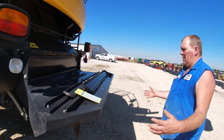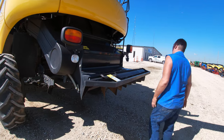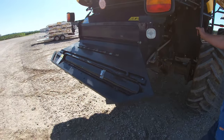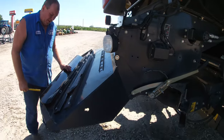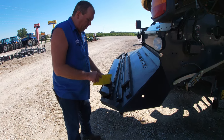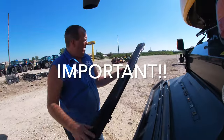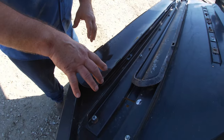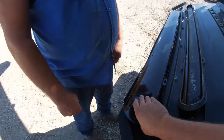For knife adjustment on the chopper, if that bolt is in the middle that's halfway in; if the bolt is all the way over, that's all the way in. For a 30-foot head I adjust the fins so it's not launching material into standing beans, and for corn instead of messing with the fins I just shoot it straight to the ground. The clean grain auger boot underneath the combine is a very high wear item. There's a right and wrong way to install it - it's supposed to be facing the grain elevator side. That wear plate is there so instead of wearing out the boot, it wears the plate out instead.